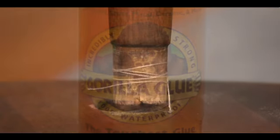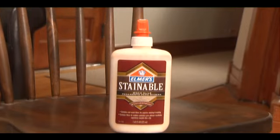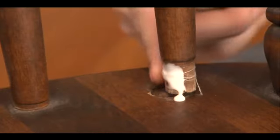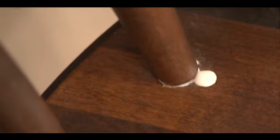Now for the glue. You can use a urethane glue like Gorilla Glue or just a carpenter's wood glue that will hold things in place. Spread it on evenly — you don't need to overglue, it'll just make a bigger mess. Insert the threaded glued dowel into the original hole.